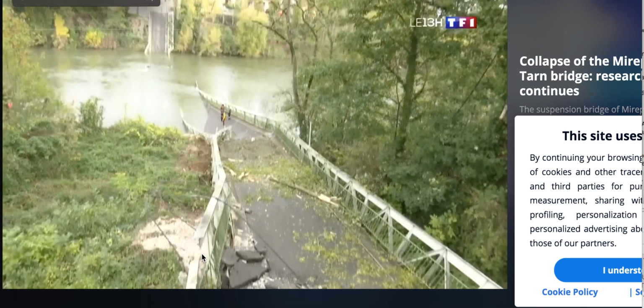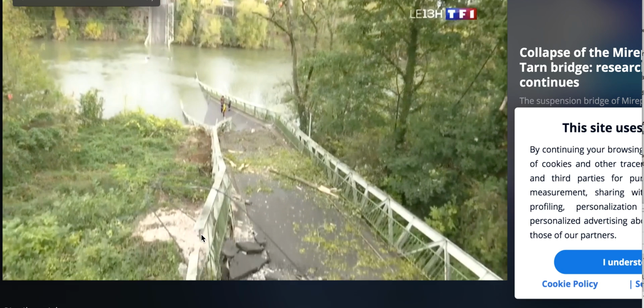It was so rigid, this part of the structure, that it just transferred the load right to the upper part of here, which is weird because it had to transfer through this little bit of steel, which would then have to break this, I guess, fabricated T-beam. How about if I call it that? It just went right through it, including the top flange. This metal seems pretty questionable, literally the metal. And no breakdown here. And this is just a small piece.